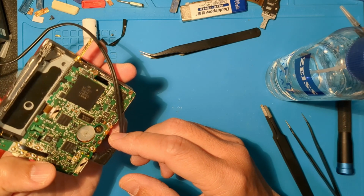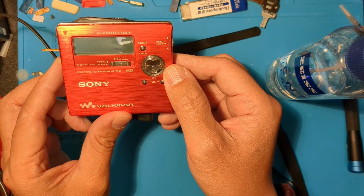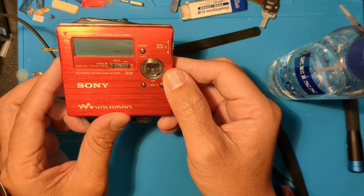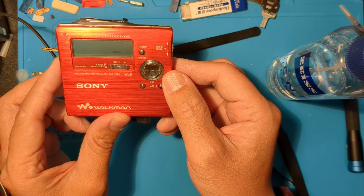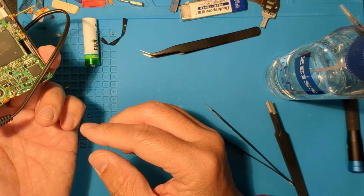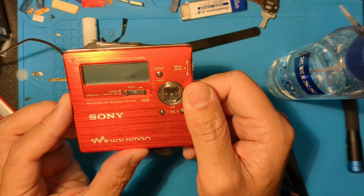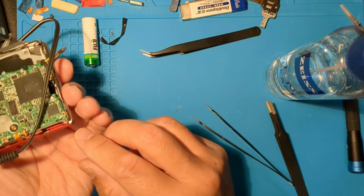Well, it didn't work. It just sat there spinning like before. I hate to admit it, but I think I got caught in the idea that it had to be the laser since the other lens fell off. I continue to swap lasers, but listening to it more closely, I can see and hear the motor keeps bumping the sled towards the center. I think I was really wanting this fix to be a laser sled transplant.